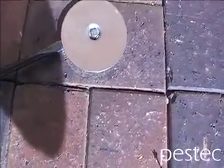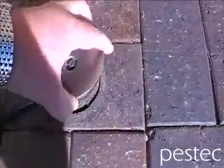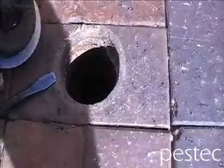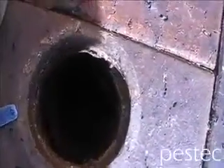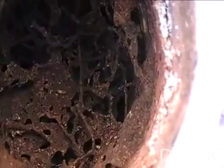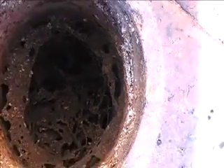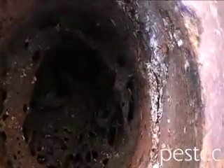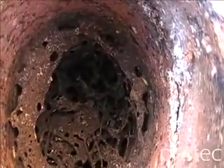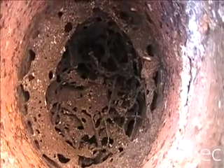Now some people say that these are not particularly effective, but have a look at this — termites galore. This is four weeks after the hole had been drilled and the timber put in. The timbers are in fact completely gone now. All we need to do here is introduce bait. The termites will eat that, taking it back to the colony, sharing it with all of the members of the colony, and that will kill the entire colony off.